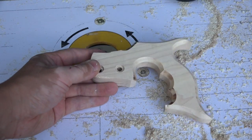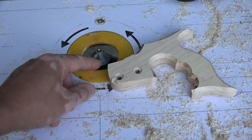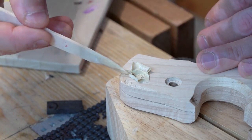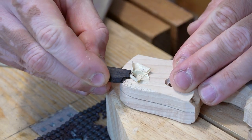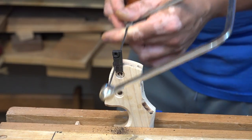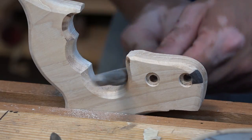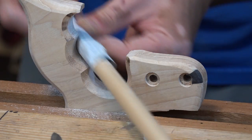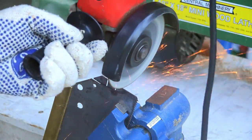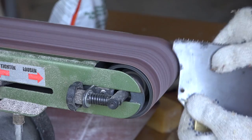I was going to try to finish this today but I accidentally hit this part onto the router — live and learn. To fix the problem I cut a piece of ebony and dovetailed it into the area where the damage was. I think the repair turned out pretty good; it gives the handle a little extra something. There was also a large piece of steel at the back of the saw plate that I thought was unnecessary, so I decided to cut it off and put a curve there instead.